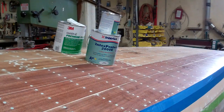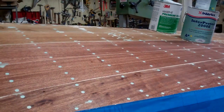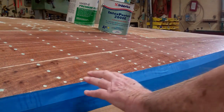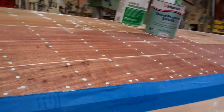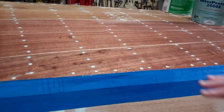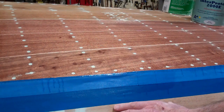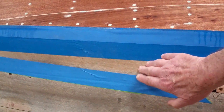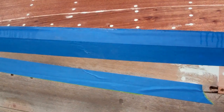And in that connection, today we will only be priming down to the actual chine, right to this edge. Why aren't we going down the chine plank and continuing all the way to the top of the waterline? That's because we have fabricated on each side a new chine plank. This right here is an original chine plank. It's fine. It will need some filler at some point, but it's the rest of the top sides